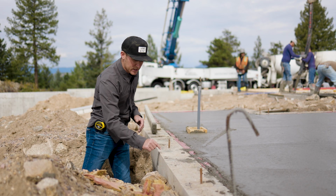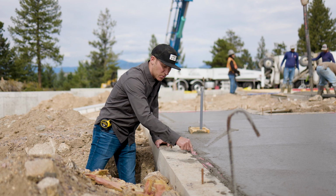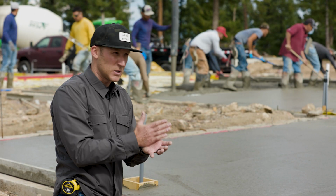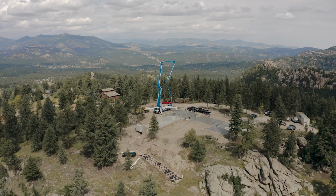this foundation wall can get really, really cold and transfer that cold energy right into the slab if we didn't have this thermal break. And this thermal break runs all the way down to the footing. So even down here, if this gets cold, this rigid foam is going to thermally break that cold, but it's also going to help not transition the warm from this slab into the foundation wall.